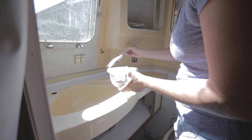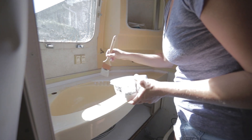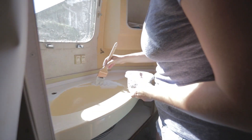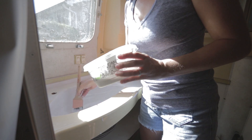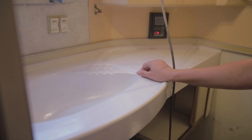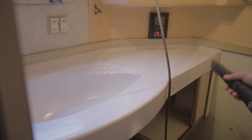Another important thing is to remember to use a good brush — one with straight bristles. I'm also using a light stroke as well. For sanding between coats we're going to use a 320 grit sandpaper — super, super fine — so we're not making any big scratches. We're basically just scuffing off some of the paintbrush marks so we can put a second coat on and have a nice even finish.